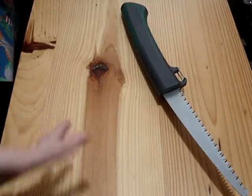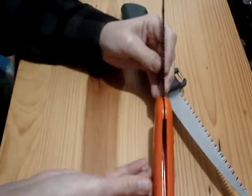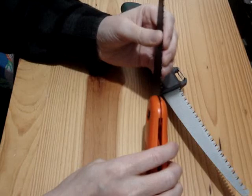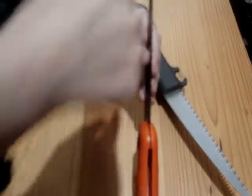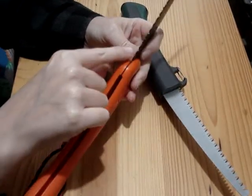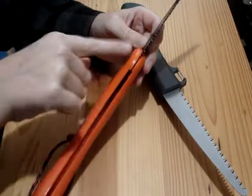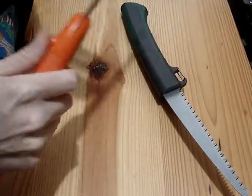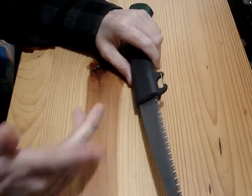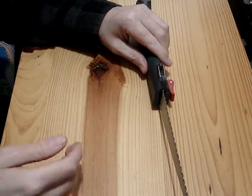There are tools made to fix that. Like if you look at this one — better saws — that's one good way to see if a saw is actually decent quality or not. But you can see the teeth go back and forth. Apparently the set is that the tooth is sharpened on one side with a bevel and flat on the other side, and the tooth is bent away from the sharpened side. I think that was the same with the other saw that I sort of fixed, because I have a setting tool over in the barn. So I'll go ahead and give these teeth a little bit of a set — and it'll be spliced onto this video.